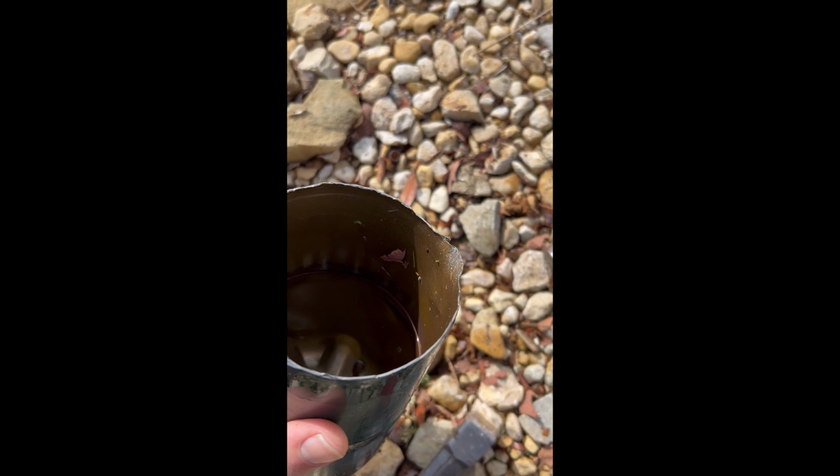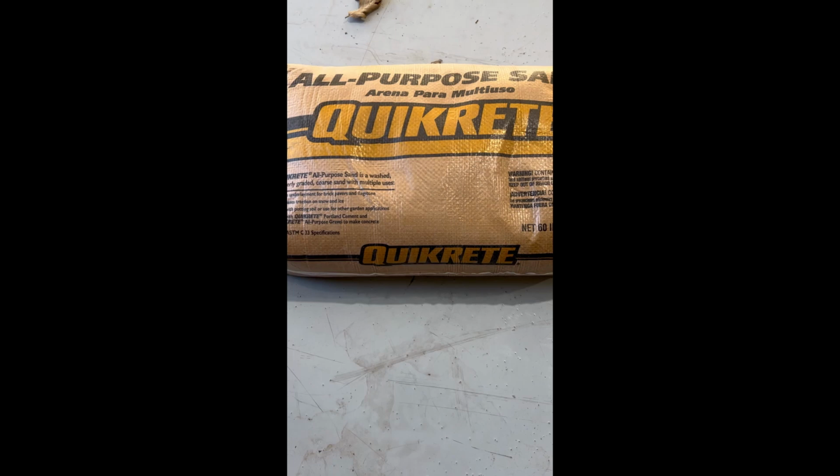All right, I'm getting set up with my 10-gallon metal trash can. It's a little bit big, but I think it'll work. Getting some steel wool out, I'm using it as a rebar for the plaster and sand mix to hold it together and make it more durable. All right, I'm getting ready to mix up my foundry mix.